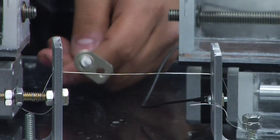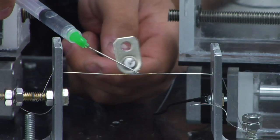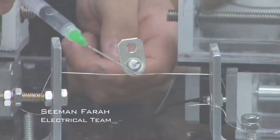My big concern is the ignition system, which prototype is right here. The droplet will be suspended on this wire right here. We came up with a new idea of just using a spark, just like on a regular barbecue — propane lights at 900 degrees Fahrenheit, so whatever ignites the barbecue we should be able to use on these fuels, because these fuels only take about 700 to 750 degrees Fahrenheit.